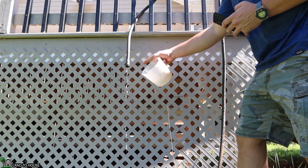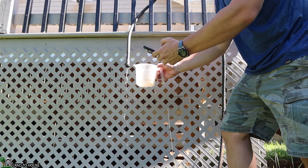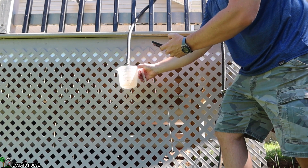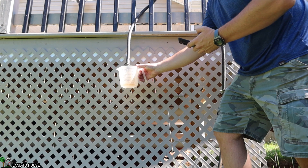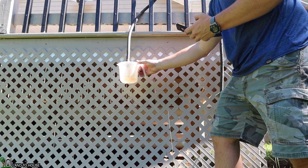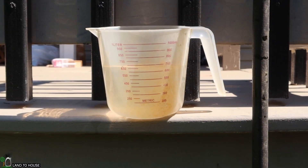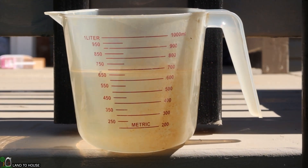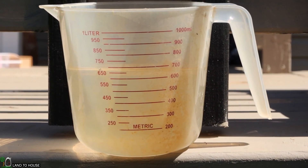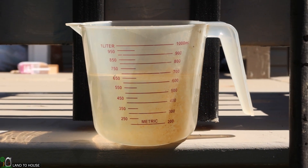Here's the output of the ram pump with the PVC drive pipe. I've got my stopwatch ready and a measuring cup. At one minute I'll stop and see how much water we have. After one minute, reading at the same spot each time, we have right at 700 milliliters — that's our value for the PVC drive pipe.